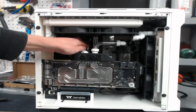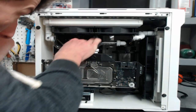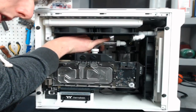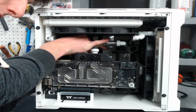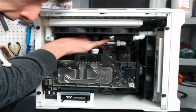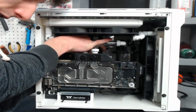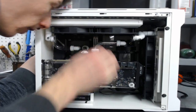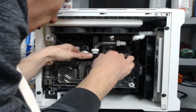As I said, I did get the drop to hold air with everything but these two runs earlier. I just capped off those ports with port covers and some plugs, and it held air that way. So I would know that if it does leak now, it would be one of these two tubes. And since the first tube that we put in went in pretty easy, I'm pretty sure it's good to go. That one probably wouldn't be the issue. It's going to be this one right here that is the bugger, if that is indeed the scenario here.